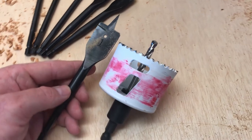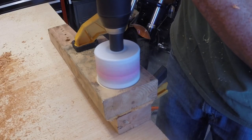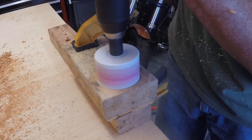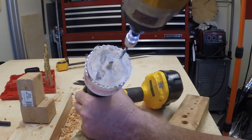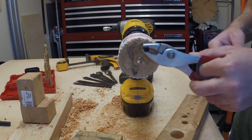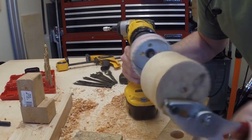Past those, you can get a hole saw, which ranges anywhere from one inch all the way up to six inches or sometimes larger. Here I'm using a two-and-a-half inch bit. These are a bit more expensive, but it's nice to make repeated cuts at the same diameter without having to reset your tool. When cutting with the hole saw, you may need to start at a little angle to get the teeth to begin cutting — if all the teeth bite at once it may catch and kick back. After cutting the circle out, you get a perfect little circle inside the hole saw itself; to remove it, shove a screw into the side and pull it out slowly as you reverse the drill.